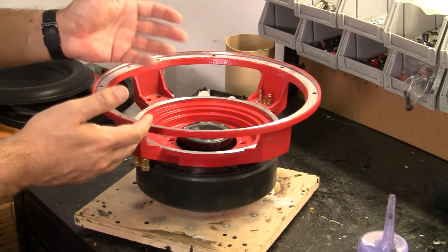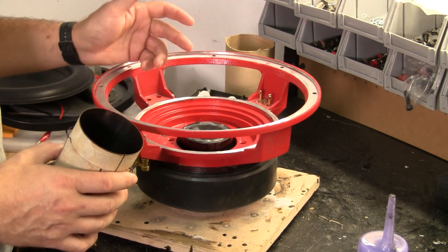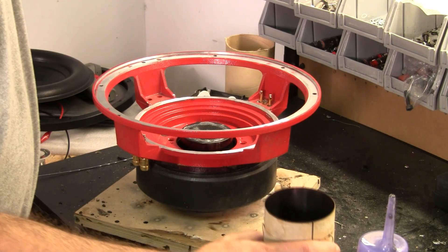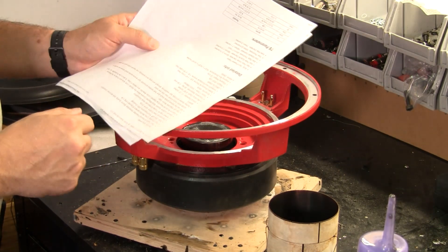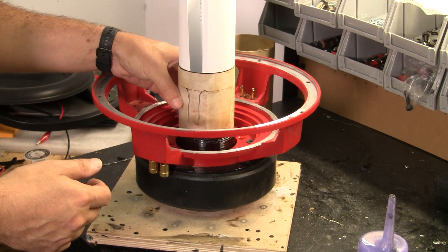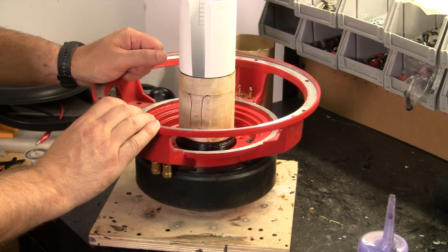As you can see I've already torn down this sub and cleaned it up — there's a link to that video if you'd like to see how I did that. Moving on: we already know the coil is going to fit because I measured that ahead of time. We need to find what shim will fit, and for that we'll use sheets of paper — nothing fancy. We know we've got the right number of shims when you can slide the coil up and down relatively freely but it stays on its own, and if you grab the bottom it won't move around on the pole at all.